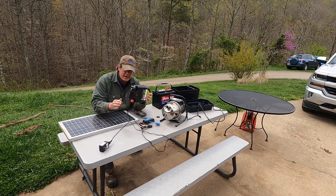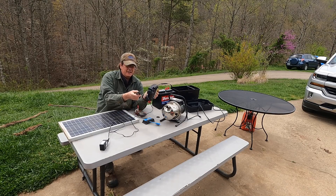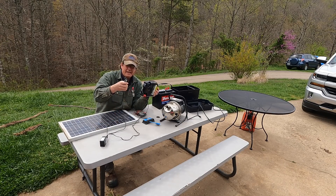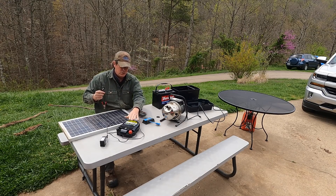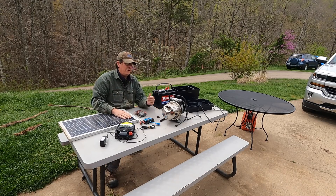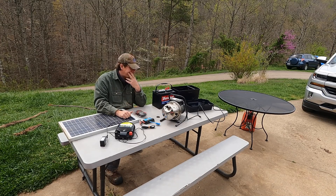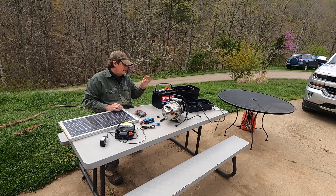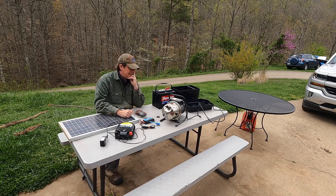The plan is to take my simple Patriot Energizer — this one is a 12-volt/110 option. You've got a plug that unplugs, the transformer — you can plug into a standard outlet or swap that cable out for 12 volts, which is just little alligator clips that go straight to your battery. I've been really happy with the Patriot; I'm not sponsored by them or anything, this is my third one. They run all the north pasture and all the south pasture. And of course we've got our battery — brand new deep cycle, not a car battery, so it can handle that extended load over time.